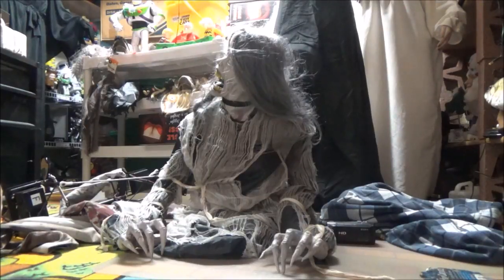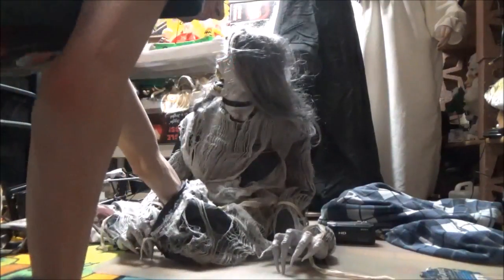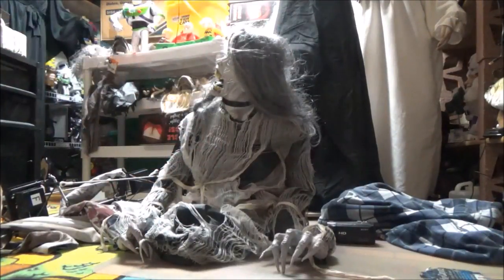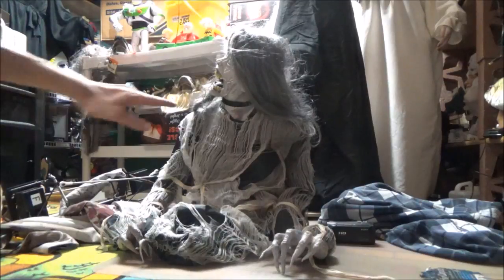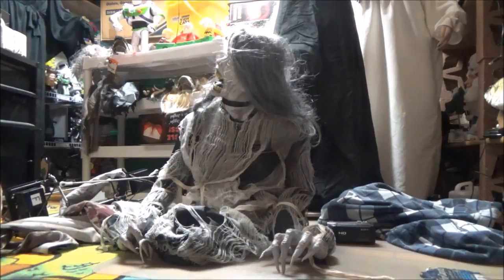I don't know, for some reason the store display at our store didn't go up and down the whole season. The first day I went, she would rise up, but she wouldn't go back down. And even if she rises up and doesn't go back down, she's still not supposed to turn her head unless both relay switches are hit. Both of them have to be hit. There's also a relay switch when she goes back down, to stop the motor from running. That's what actually broke on my old 2010 Demonica, and that's what really killed it.